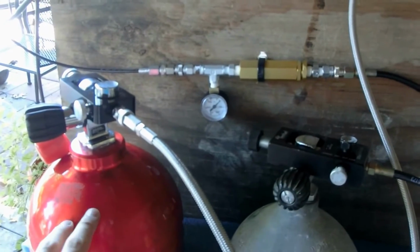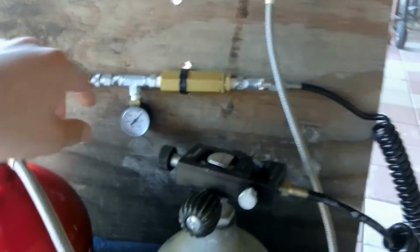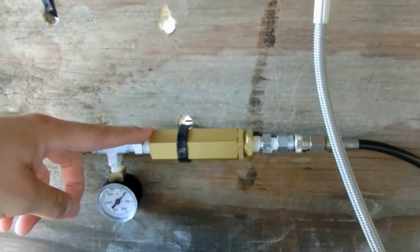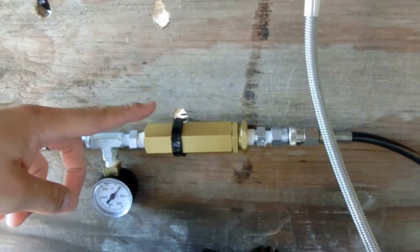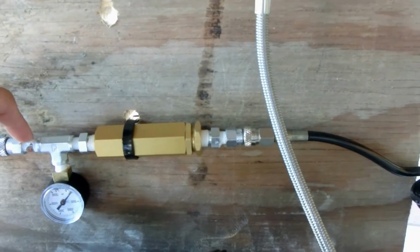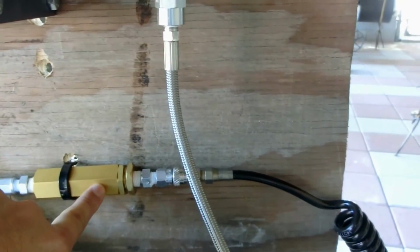But pretty much, for me, the only things that I had to acquire were this additional K valve, the fittings, and the regulator. Word of advice: if you do go to Aqua Environment for your regulator, they have this one and they have another one. This one can regulate air from 100 to 300 psi. The max psi on the high side is 6,000 psi.